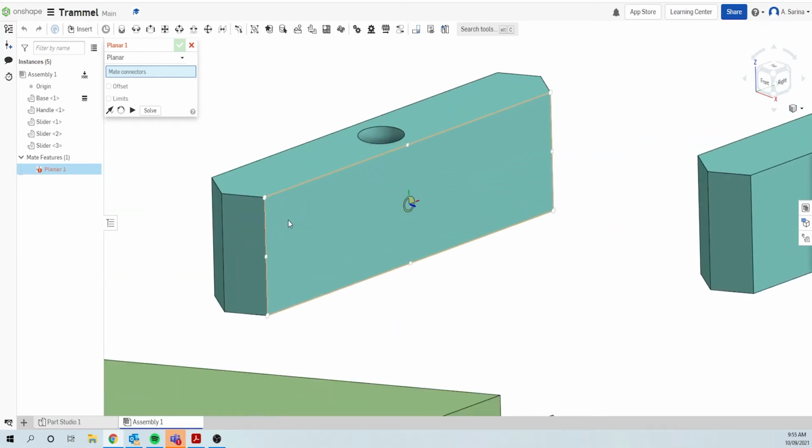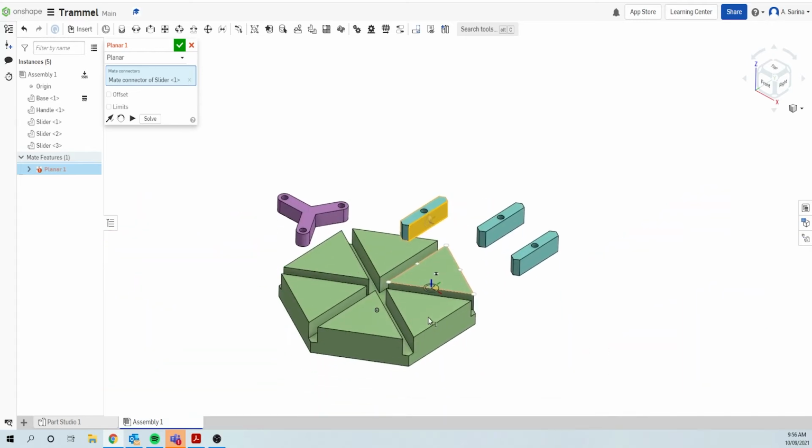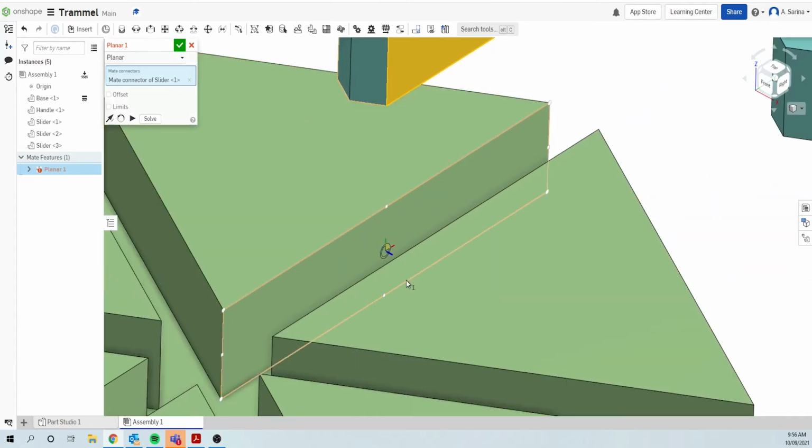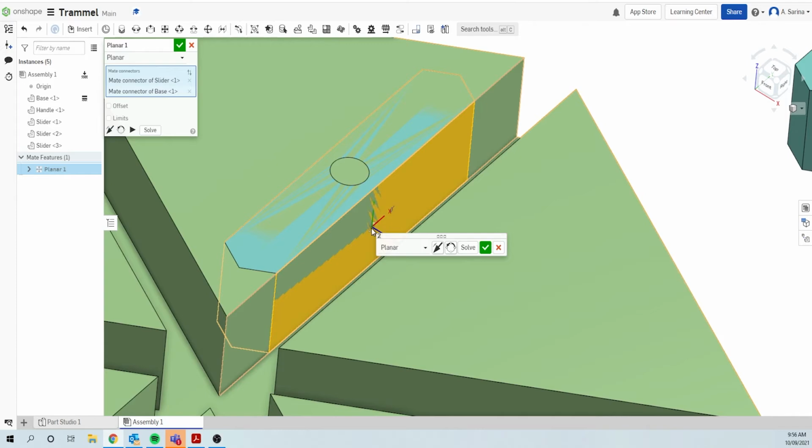So remember, when we mouse over one of the sides or faces on our parts, we get all these dots, and they're called mate connectors. We want to go the center one on the side of our slider. We're then going to zoom in on our base, and in one of the channels you're going to click the mate connector which is on the center of the side of one of our channels. So I'm going to click that one.